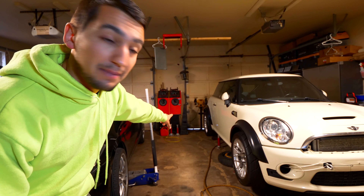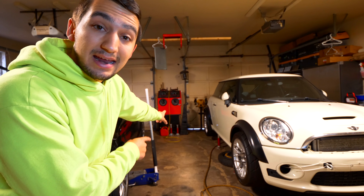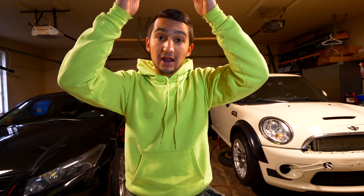Of course, if everything else is insulated that's also a plus, but I'm not going to be spending a lot of money to get this thing super warm. Even looking at the garage, you can see the little gap down there — if you can even just get rid of that, it will make a big difference too, because cold air sits lower than warm air and will creep into the garage through any gaps. If you have any gaps up top, that's where the heat is going to escape. So if we can block off cold air from coming in and prevent warm air from escaping, we're going to have ourselves a nice warm garage and be able to work on whatever car, whenever, without freezing.